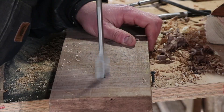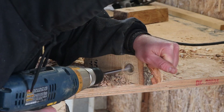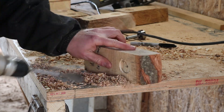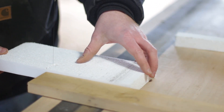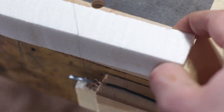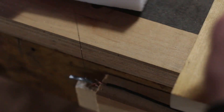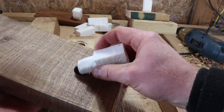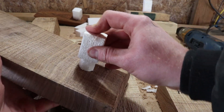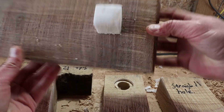All my test pieces had a hole bored all the way through, and most of them had a countersink on one side. To give the tests a little bit more usefulness for me in the future, I cut some pieces of polystyrene so they would fit in the holes in the different species of wood. These will burn out and leave metal in the shape of those pieces.